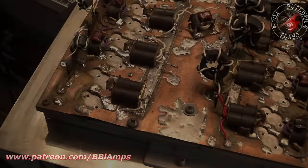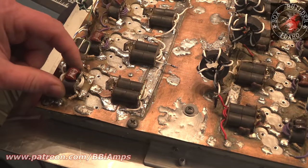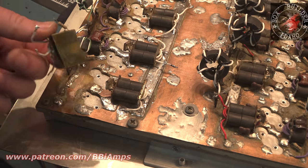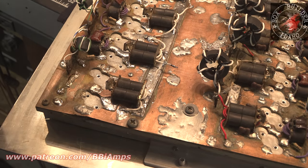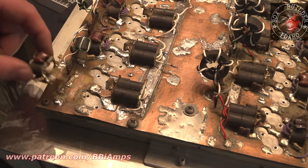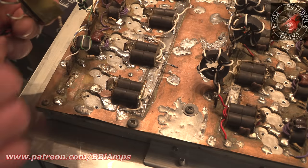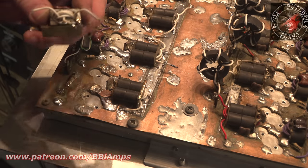Damn, I gotta highlight this. This was sitting like so. Instead of just repairing the trace, they had double-sided stick tape they put down. And they hand-cut another bullshit board, and then they stuck that on top. Had the 10 ohmers holding it down, and then this piece of wire.